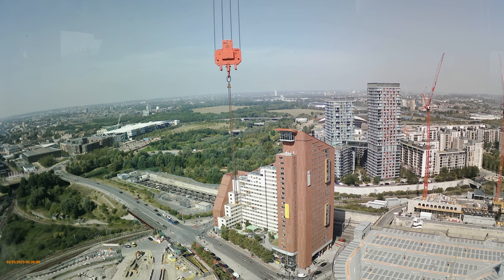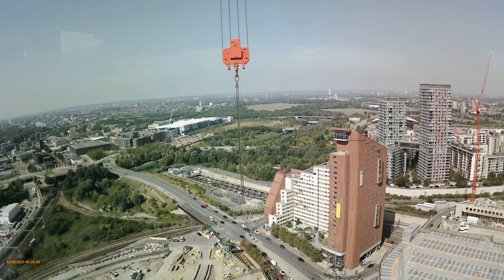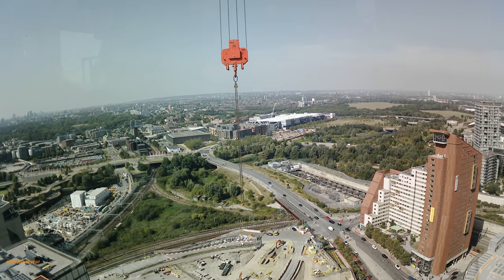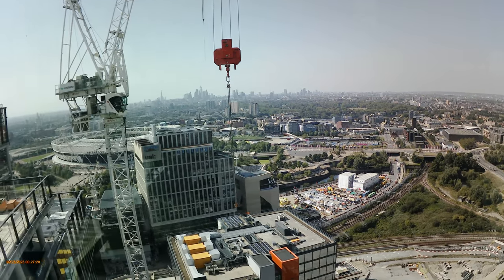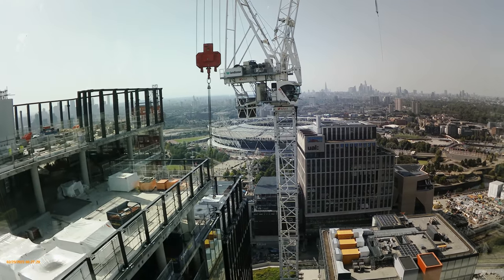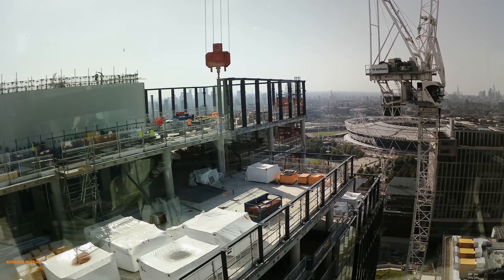This works with the slew as well. If I want to go back to the previous target of that stillage, I've got three speeds on the slew. Starting in one — there's a bit of a delay on the hook, wait for it to come over, down to two to keep up with it. It'll lag a little bit again and gradually come back — three, that's full speed. There's not much movement in there at all. Now I'm going to start slowing down again — clock down to two. I've got a little way to go so I won't clock down again yet.